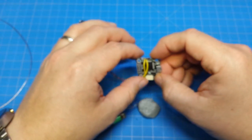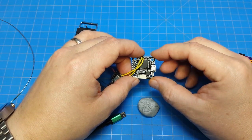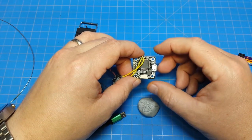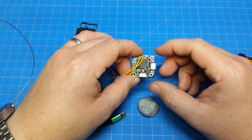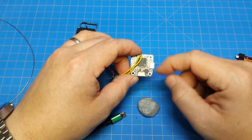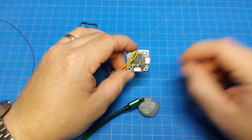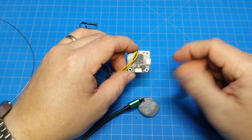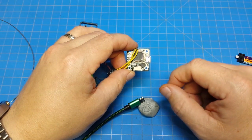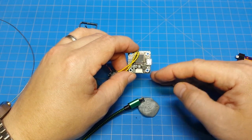I have one other thing to contribute about this board. I'm not certain about flashing ESCs with this board — I know it will work, I've done it. But I've had arming troubles with the board I have in a vehicle, and I found that I had to switch from Betaflight 3.1.7 to Betaflight 3.1.6. It would arm kind of odd — once out of every five times. But if you plugged in the USB cable and hit your arming switch, it would arm every time. Put the battery in on the ground, sometimes it wouldn't arm, and if you crashed and disarmed mid-tumble, it wouldn't arm again.